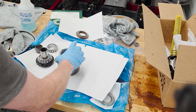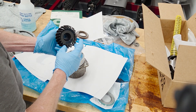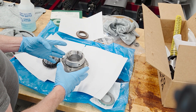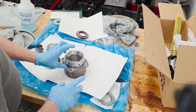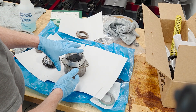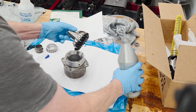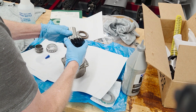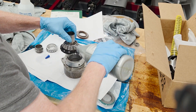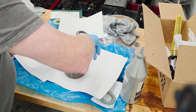I got this all pressed apart. All the bearings and gears look virtually brand new - there's virtually no wear on this gear. We're going to try to put it back exactly where it was using the same shims. I took that dimension, and I'm going to try to press it together, get the rolling torque, and hopefully the dimension is the same. We've got some synthetic gear lube we're going to put on here - I rinsed it all out in clean parts cleaner and I want to lube it up real well so the oil gets into all the bearings.